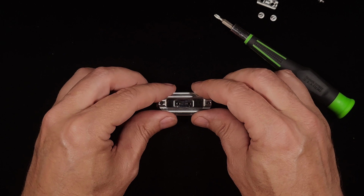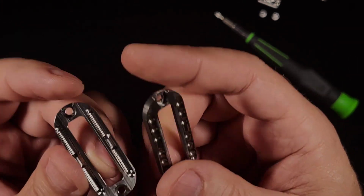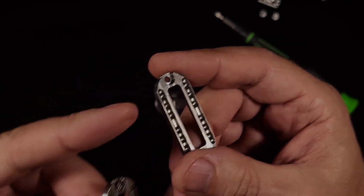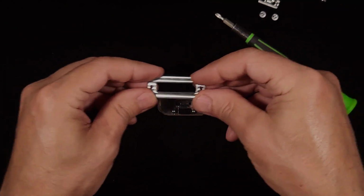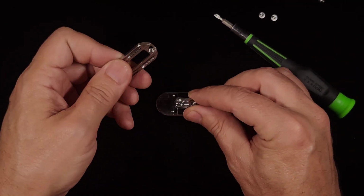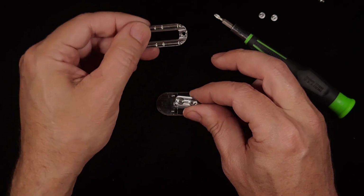But now if I just lift this plate off, you'll see this is the difference. This is what they call, I believe, the ZZ plate, and possibly this is just the Z plate. But the difference is remarkable, and I do not care for this. So that's what the balls ride on when this goes back and forth. This piece here is merely an anchor piece that stays in the middle, then rides this inside track. That's what keeps this going in both directions and limits its travel.